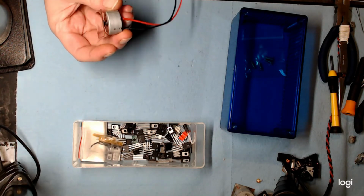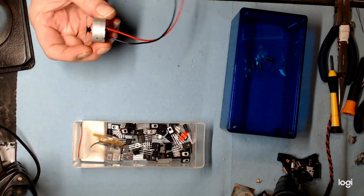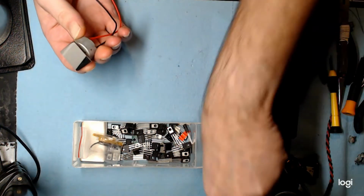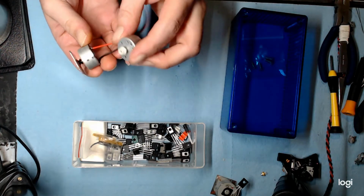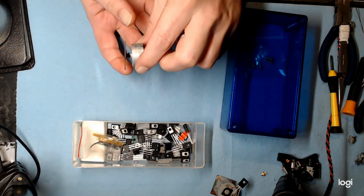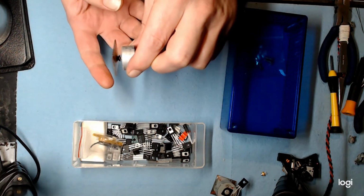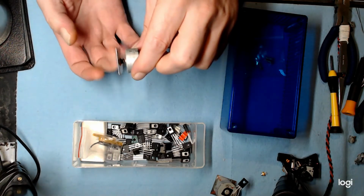So I'm using the motor out of a DVD drive. It's the tray motor, and I left the pulley on the back, like you see on this one. And I epoxied the first surface mirror, found the center, and then just gave it a slight tilt. It has to have a bit of a tilt or you don't get an effect, right?